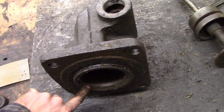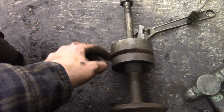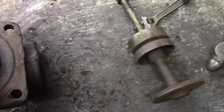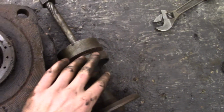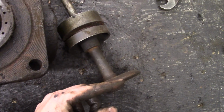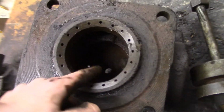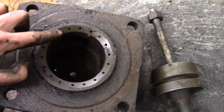So there I figured out how the gas goes from the diamond valve or the governor to the actual delivery ports on the intake valve seat, but I didn't understand why it had to go through these slots and this piston thing here. And my best guess, maybe one of my viewers can correct me here or add on to what I've guessed, is that this is sort of a crude overspeed governor. Because at low speed, this intake valve will probably open just a little bit, and this piston will still maintain its position such that gas can flow from one slot to the other slot, down that channel, and then out these discharge ports.